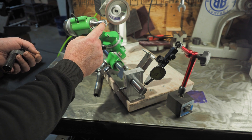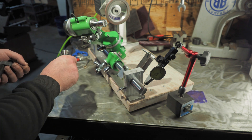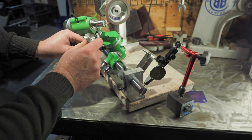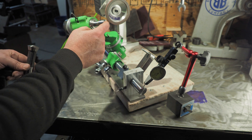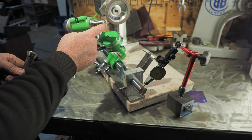So if I had to do let's say a three and a half millimeter size, these aren't quite as accurate unless they're close to the nominal dimension. And so you kind of gain that back with the ER adapter. Just wanted to point that out.